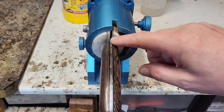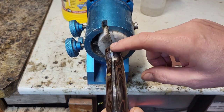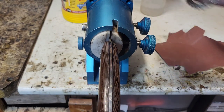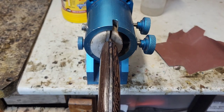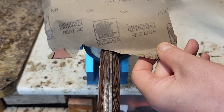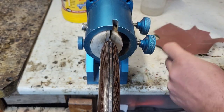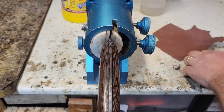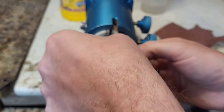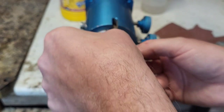As you can see, I'm going to start with the handle area. You can see these little bits of surface rust where basically the knife's been put away wet, which is never a good idea. All we're going to use is some 200 and 1000 grit sandpaper and a tiny bit of WD-40, and then literally we're just cleaning this up before we polish it all back up again.